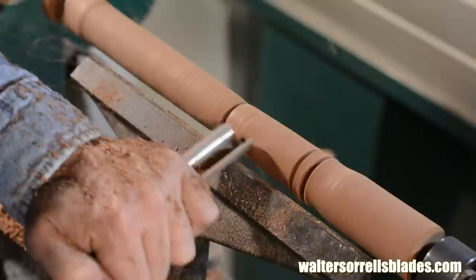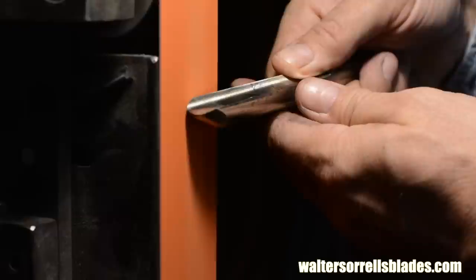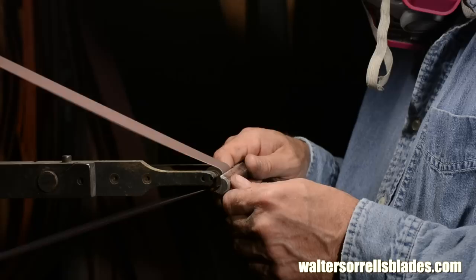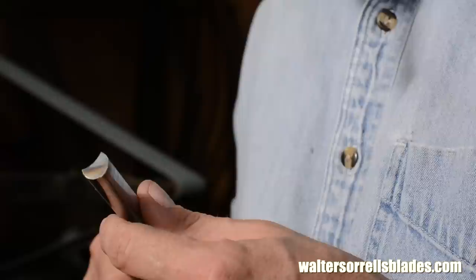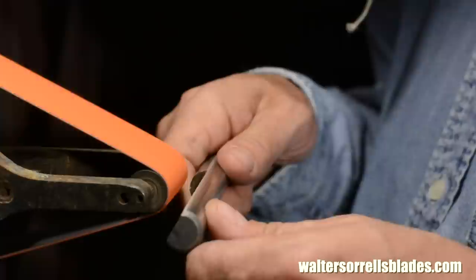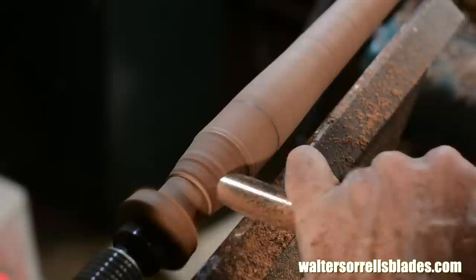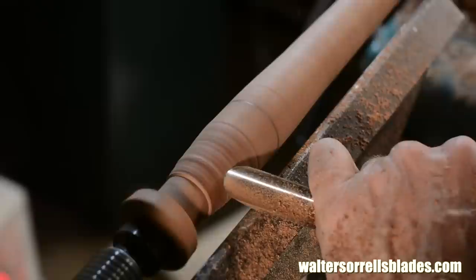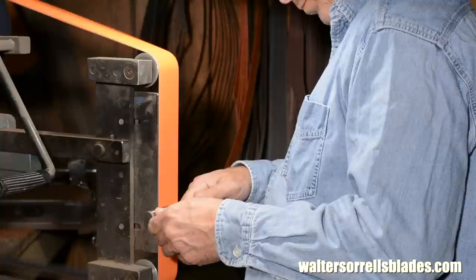But on the plus side — and this is not a minor thing — all we have to do is grind it, slap a handle on it, and we're done. Now, if you're already an experienced woodturner, you'll know that depending on how you grind this, you can make a spindle gouge, a bowl gouge, or whatever. The techniques used here will be applicable to all kinds of tools if you can grind the flute in the center to make it fit the kind of tool you're trying to make. The basic geometry of the tool we'll make will have a cross-section that looks sort of like a big smile. If you buy professional gouges, they'll have somewhat deeper flutes than mine does. They mill them out using side mills or dedicated grinding tools that I don't have, but that doesn't mean this won't still work. Bear in mind that you may have to learn to use this tool slightly differently from commercial gouges, but trust me, this will make a tool that works — I've tried it, and it does work. Also, you may not have the tools that I do, and so you'll have to modify your design a little to fit your grinding gizmos.